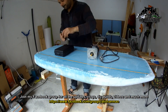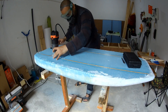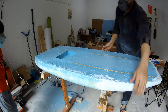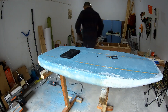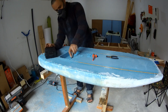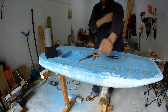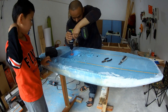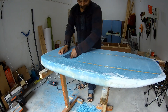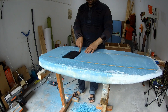Starting from the top part, I confirmed the measurements for the box, then using my router I cut the first profile which was easy, and after that I had to cut deeper. I did not have any bit for that, so I used the carpet knife and my favorite circular drill bit, which actually did the job very well. Check this out — the box actually fits really nice. Perfect finish right there.